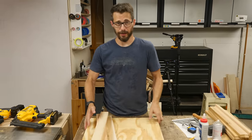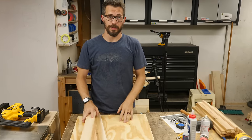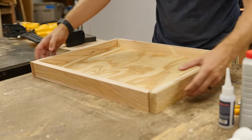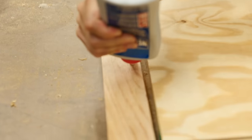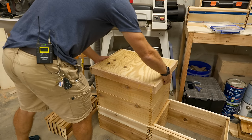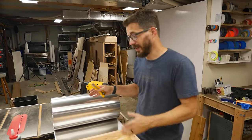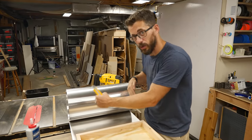The inner cover is done, so now we're going to make the outer cover — this is really just a box with a flat top that goes over the top of the entire hive. We're going to wrap this with some aluminum flashing to make sure that no water gets down on the inside of the hive, since rainwater will collect on the top and the flashing will help stop any wood rot. You could make any kind of roof you wanted to — a slanted roof, shingles — but I really like the flashing and the wood grain look I saw in that photo on Google Images. We actually used this same wide aluminum flashing previously on a treehouse slide, and luckily that same flashing works to cover the top of this.